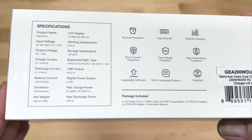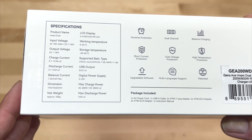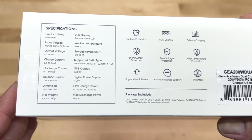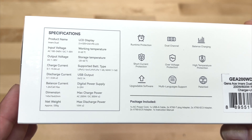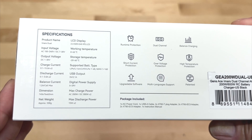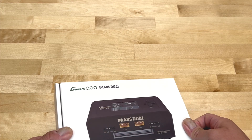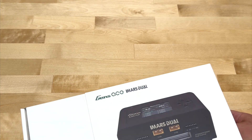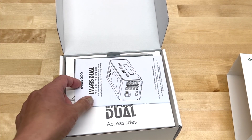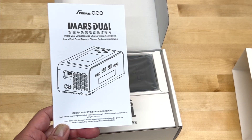If you've ever had a battery that seemed to take like two hours to charge, that's really why. What happens is it ends up charging all the cells at whatever amps you're doing — maybe 5 amps — and then once one of the cells hits maximum voltage, 4.2 volts on LiPo, it'll start balancing using the little connectors. If you only have like a 200 milliamp balance charge rate, that's why it takes forever. So 1.2 amps is really nice — it will actually charge a lot faster those batteries that have mismatched cells.